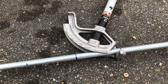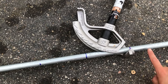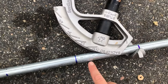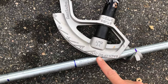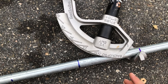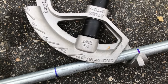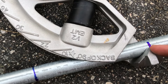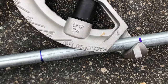In the book you're told to draw your center line and mark five inches on either side — it shows the arrow lining up with the side mark and the star lining up with the center mark. When I tried lining it up that way, my bend was not perfectly centered on the pipe. The second time I tried lining up with the star and that didn't work either. What I came up with: I lined up the end of the bender with my five-inch mark, and by doing that my bend was perfectly centered. Leave a comment below if you had difficulty with this or know the right way to bend these conduit pieces.